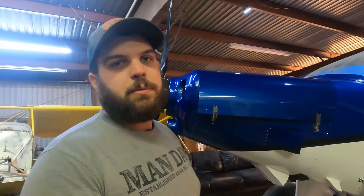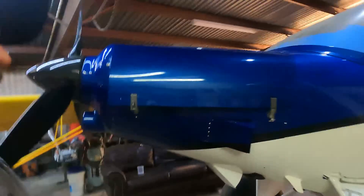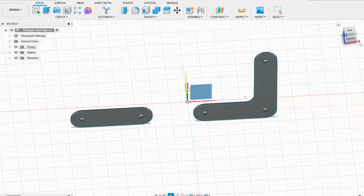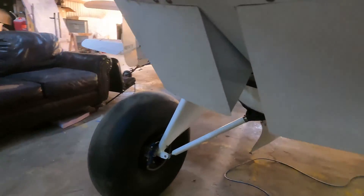Because we're operating in West Africa in the Sahara Desert, I wanted to do everything I could to make this engine cool well. I've got a video coming up that'll cover everything inside the engine bay with the plenum and all the stuff to keep it cool. The cowling is part of that as well. I ended up deciding to run four cowl flaps on this, which I think would be overkill most of the time, but when we're planning on flying in 100 degree plus temperatures fairly often, I decided to do everything I could to cool it. We've got these cowl flaps on the side, and if you look in the back you can see the linkages right here. I drew these up in CAD, had them machined out, and I've got the linear actuators in there. There's one here, a pair of cowl flaps down here on the bottom, and then on the other side there's a matching one.